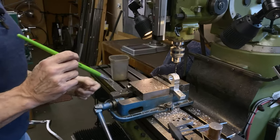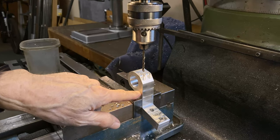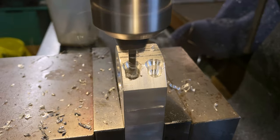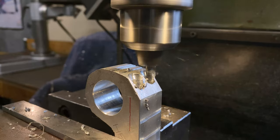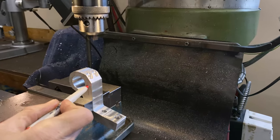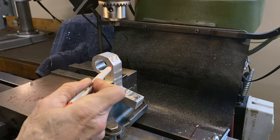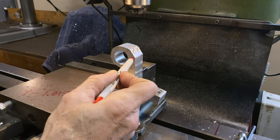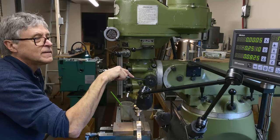What I got here is a 4.2mm tap drill. I'm gonna plunge this down to, I don't know, somewhere around here. After that, we'll make a thread. So we're gonna go down to about there. That's gonna be a 5mm drill down to there. And the head of the Allen screw seats right there. So we have that much space for which the head can rest on and support.